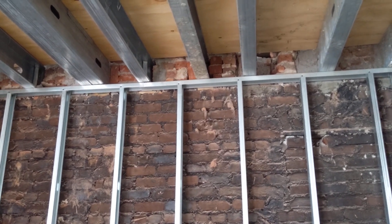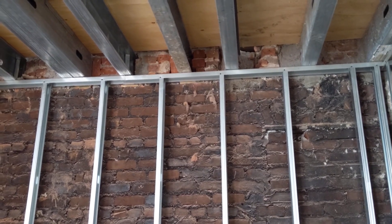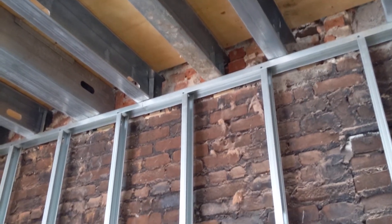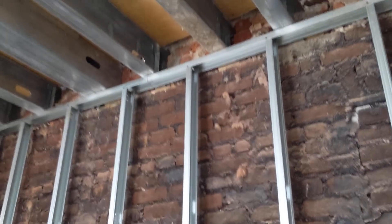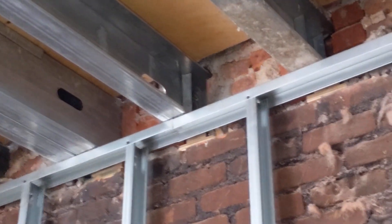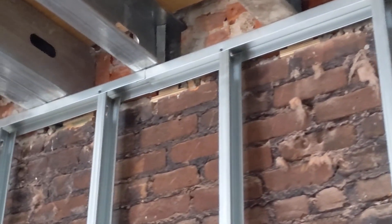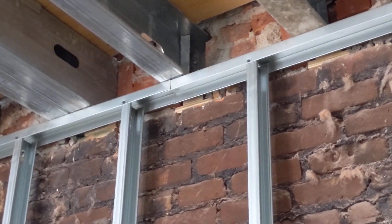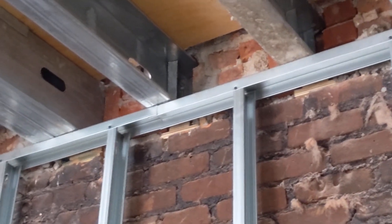The answer is because these joists are actually pocketed into the brick wall, which means they're not being supported by these studs — they're being supported by the brick wall itself, sitting inside it. The studs here are just for the sheetrock finish later on. And you can see on these joists there are stiffeners — little pieces right there inside each one. What they do is exactly what the name says: they stiffen the joist so that when the brick sits on top and all the load comes down, this stiffens up that portion so the load can travel down through the brick all the way into the foundation.